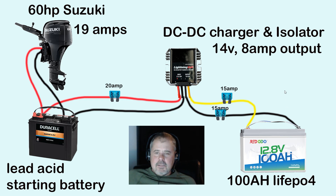This is late 2024 that I'm filming this. You can buy a 100 amp-hour battery for as cheap as $160 or as much as $220 to $230. The average price is going to be about $200 to $210. Redodo has a Bluetooth interface now — the last couple of batteries I bought, I paid about $215 for a 100 amp-hour one with Bluetooth. I strongly recommend you get the Bluetooth interface that connects to the BMS. You can see how much power it's outputting and how much is going in when you turn on the outboard.